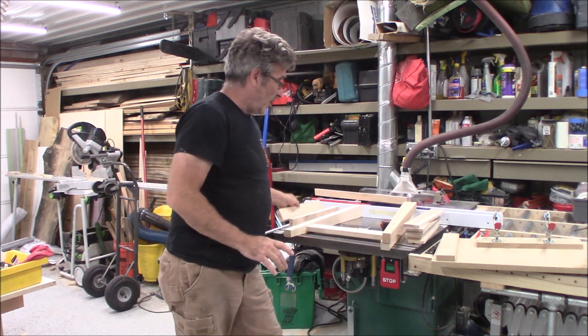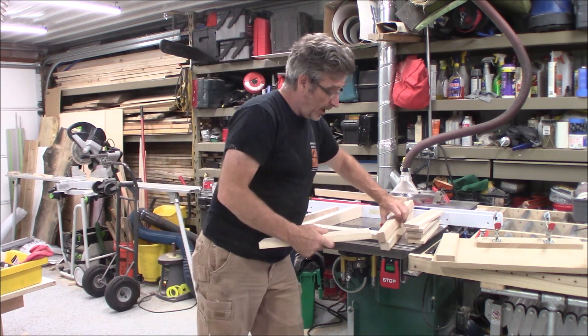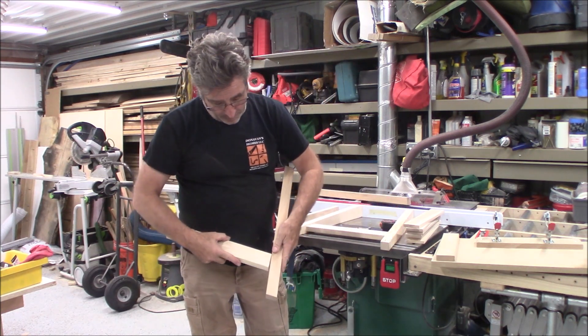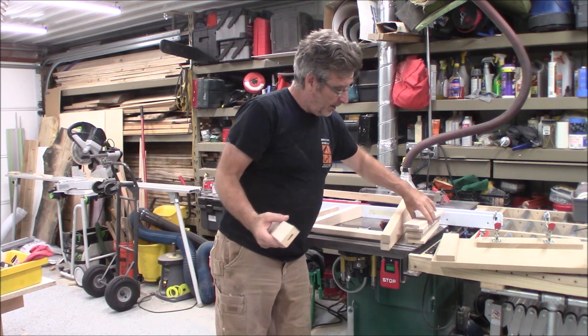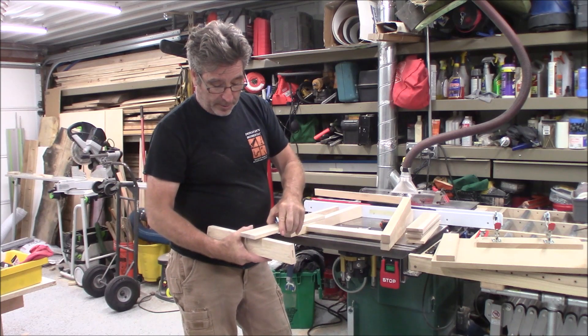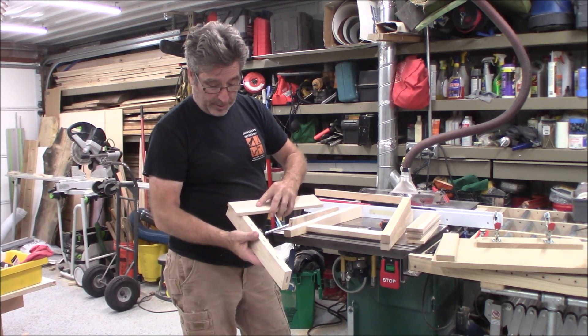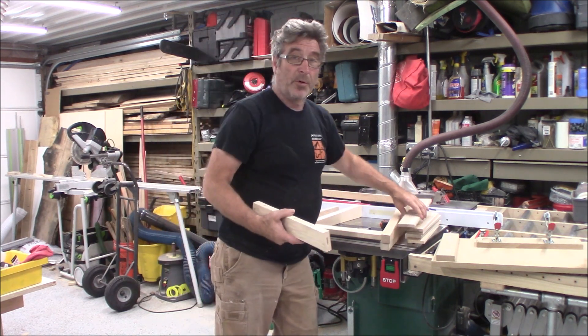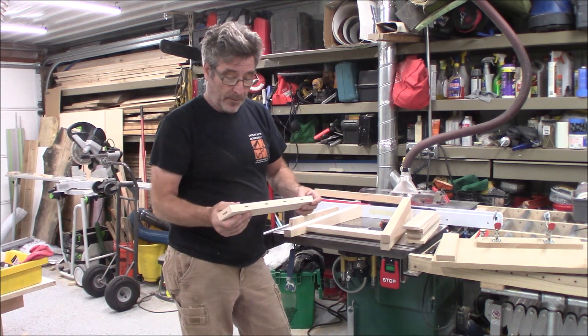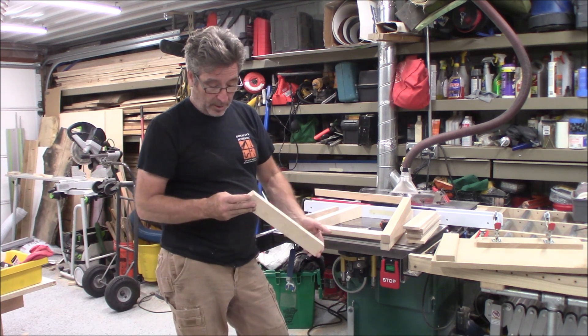For the spreaders and how I'm going to put this together — I've got the domino here that will come into the leg like so, and then these will be the shelves. I laid those all out and this will be a small domino that I'll just glue in that way. So when I'm done with the project, there will be no mechanical fasteners — it will all be dominoes and glue.